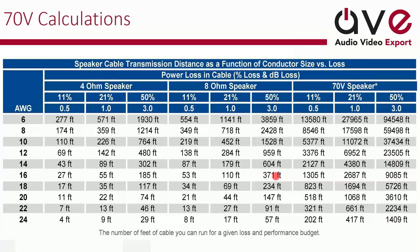For the same 3 dB on an 8-ohm system, you can only go 371 feet. If you wanted to go even one-third of that 9,000-foot length, you would have to use a 6-gauge cable, which is really not common in audio video. Most Phoenix connectors can't even support such a big cable — the biggest I've generally seen is 12-gauge. I don't like going 8-ohm on runs of 1,000 feet or more. You do sacrifice a little quality going 70-volt since it doesn't reproduce low-end frequencies as well, but on these applications you're not punching up the bass anyway, so it really should not matter.